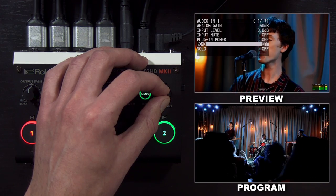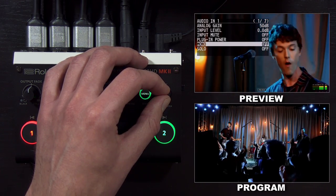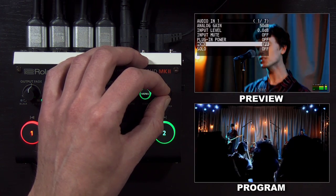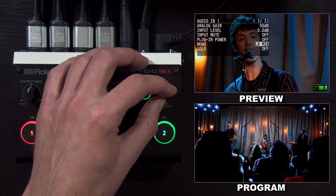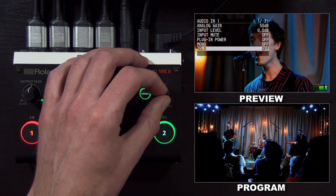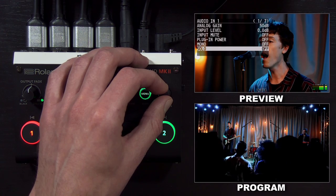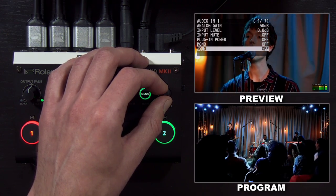There's also a mono setting. So if you have a stereo source coming into that eighth-inch input or the HDMI input, you can choose just the left or right channel or mix them together. If you want to hear one or more sources in your headphones, turn on the solo function. A helpful troubleshooting tip: if you're only hearing one source in your audio mix, there's a chance that solo is enabled for that source.